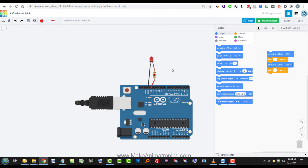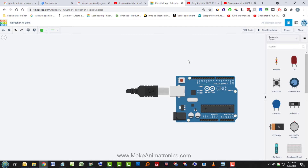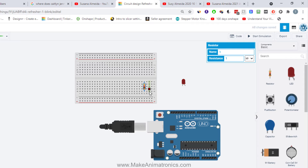That was plain wire. Now let's use a breadboard. In Tinkercad the USB power cord comes in from the left, but on my bench it comes from the right. I'll move the Arduino over and bring in a breadboard. Let's get the resistor and LED out again and wire it up using the breadboard. If I set the resistor here, all the vertical connectors in a column are one node, so placing it straight across will short the two leads together — that won't work.